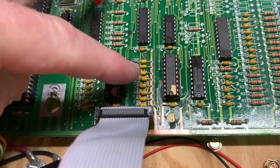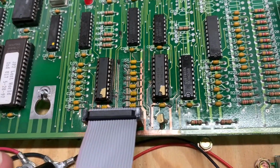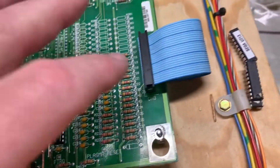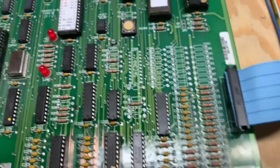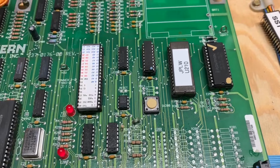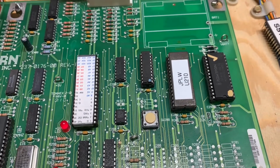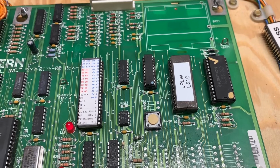Of course, socket and replace the HC245s that are there. The 3904 got hit. This header got hit. This header over here got hit. Fortunately, everything up top was in good shape. The only other issue with this was, for whatever reason, the game ROM was corrupt or defective.